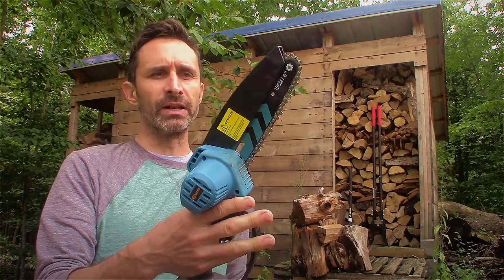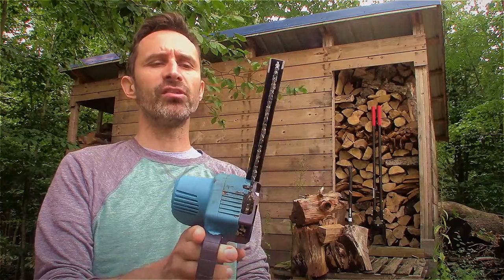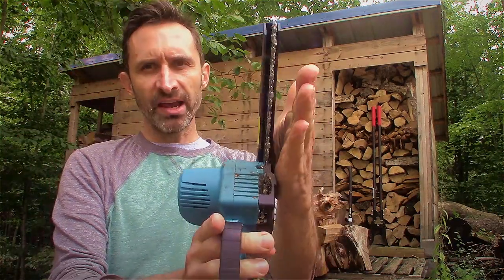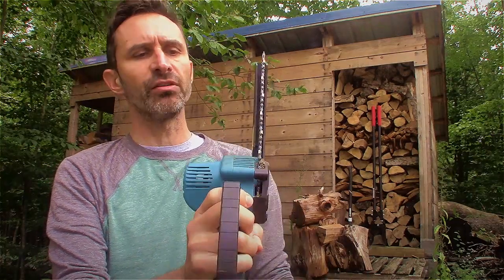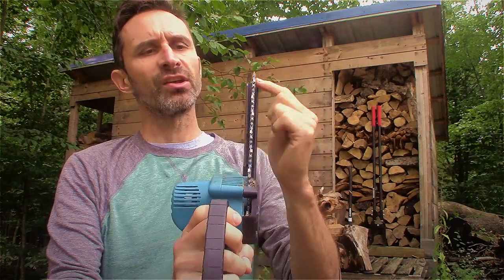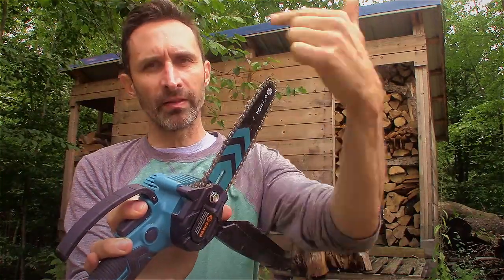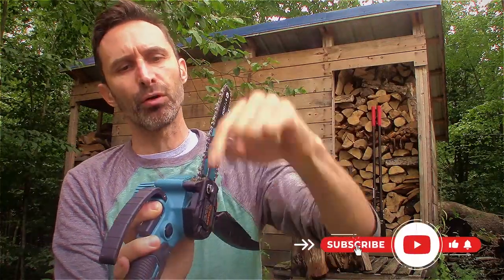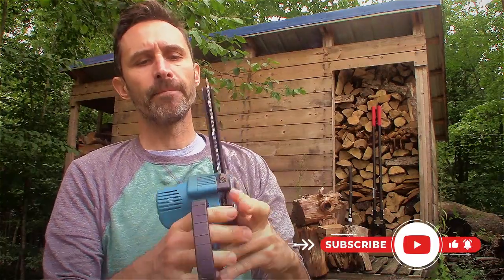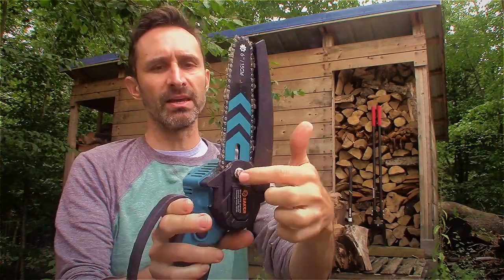I just want to interrupt this video — I was running the saw a little bit after I shot that earlier video and I still think it's very useful, and everything I said I stand by. But I noticed something I should mention: the alignment of the chain here and your fingers down here. They've got this little guard, but I'm not really sure what it's intended to protect you from, because if this chain ever breaks it's going to fling around like this — it's going around that conveyor belt — and it's going to flop down in this direction right across your fingers and still be getting pulled up into the uptake.